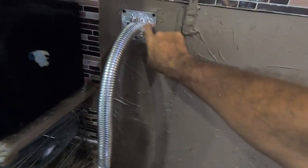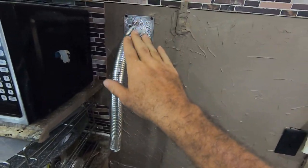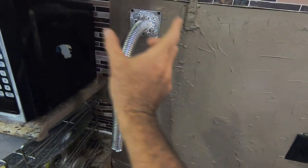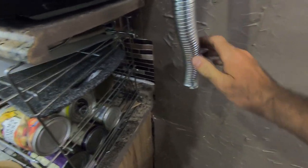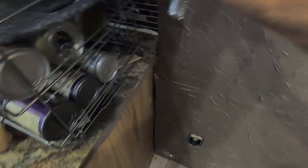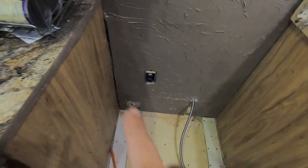That gives me a gap so the pipe can go through the wall without touching any insulation or studs. I taped it up with heat tape, cut it, and now it's going to go right on that burner. There's the line from the burner — I've got enough rise; it'll be perfect. There's the intake, there's the propane — leveled it out.